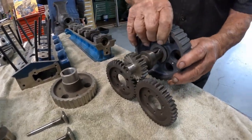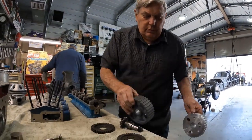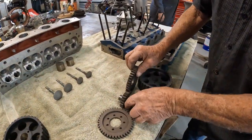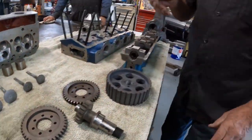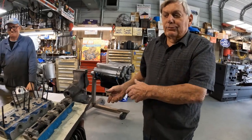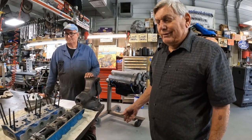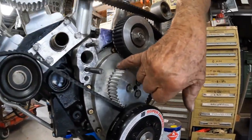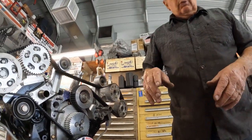There was a belt drive from the crankshaft — this went on the crank — and then one of these on each head that turned these gears. When you have a gear drive, you're going to reverse the rotation. So all 50 cams we had were made to turn in reverse rotation. Cams are expensive for us to make — about a thousand dollars each, with machining, heat treating, and grinding. So Kevin came up with the idea of putting the marine gear drive on the pushrod cam.